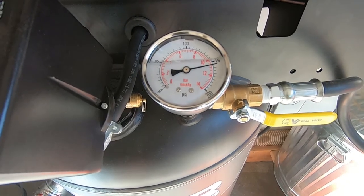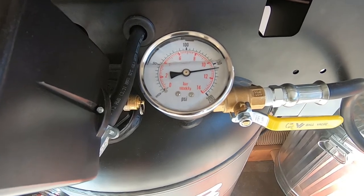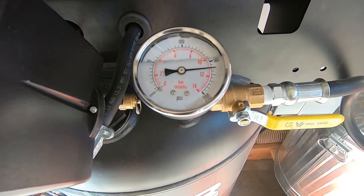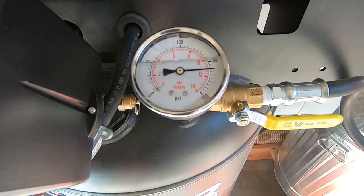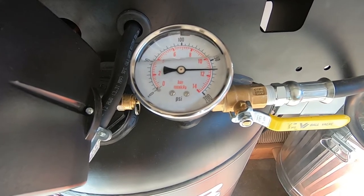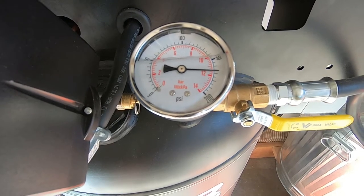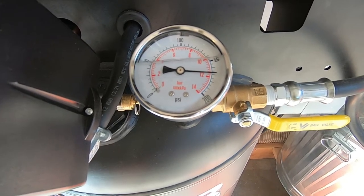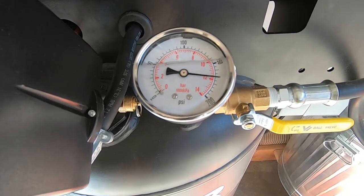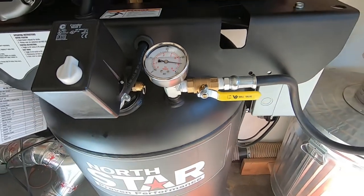So you can see that during that cut, with the 80 gallon reserve, the compressor never even had to kick on, and I had full power to the tool the whole time. Right now, I wanted to film this and show you that rapid recovery that we were talking about. I mean, this thing is screaming fast to refill, and that's why it has an advertised 100% duty cycle. They obviously don't want you to run it nonstop all day long, but even if I was still using the tool, I would still be within the range of full power because of the size of the pump.